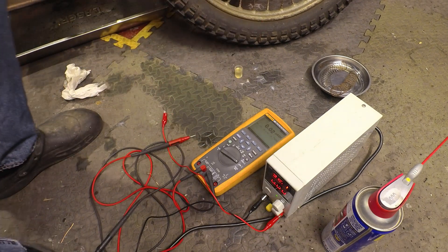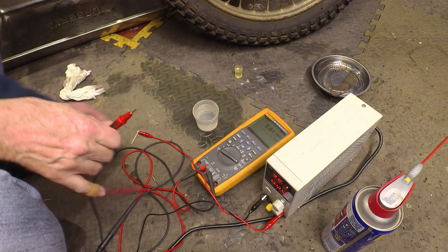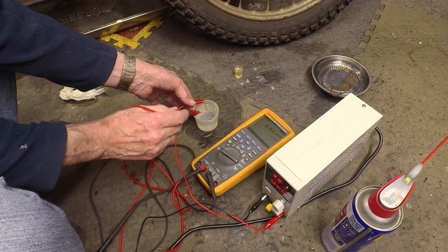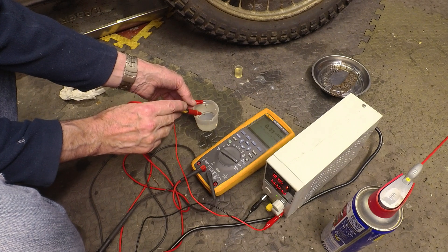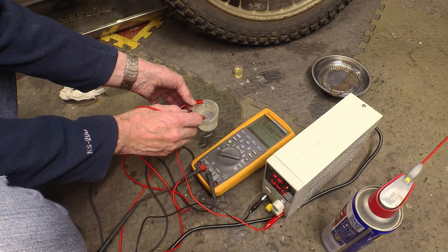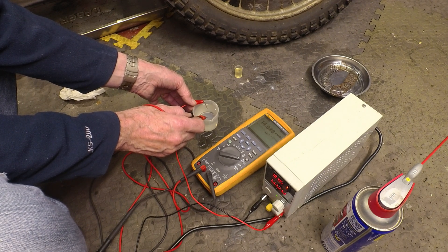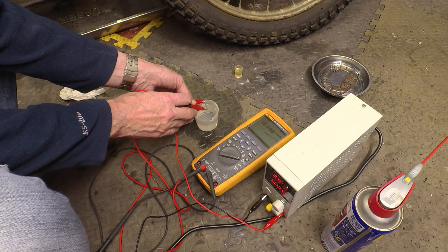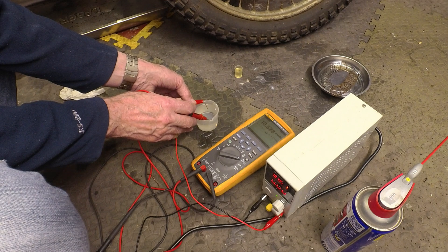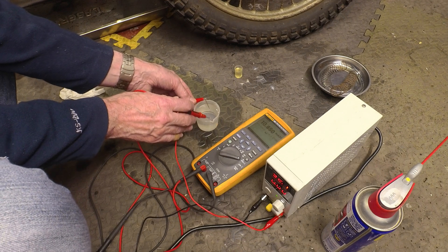Just for completeness, let's try it with water. Okay, so this is just tap water straight out of the tap, so it's by no means distilled — it should be reasonably clean. Let's try that again. One side in — oh, overload! Turn it down onto the milliamp range. 12 milliamps, 13 milliamps. Move these close together and it increases — yeah, 25. So that's around 10 milliamps compared to 0.04 microamps for the WD-40, at 32 volts potential difference.